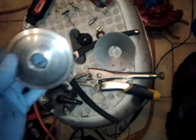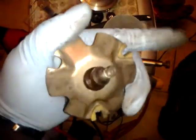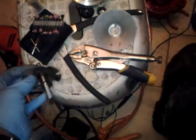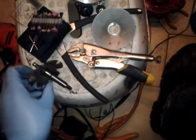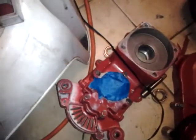This part was pretty much already 3/4 inch so I didn't have to bore it out, but I am going to smooth it out in there for a perfect fit. Then I have the rear piece which I also bored out, and I just have to add the key slot. Once I'm done with that I can pretty much reassemble it to its housing.